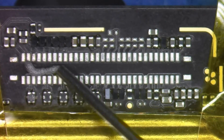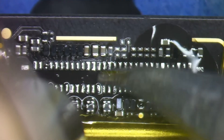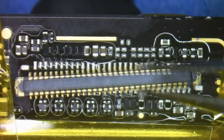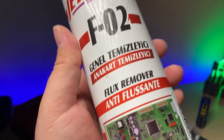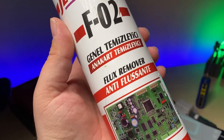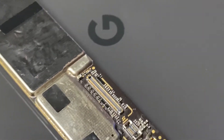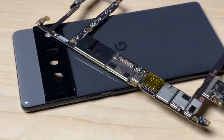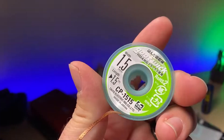One of the more important things is to know the different types of solder and their purposes. If you're working on a component that is going to see repeated action like a connector — where a connector is going to be popped off and put back — using a lower melting solder will not be suitable because it is a weaker solder and will not withstand all of that wear and tear. Whereas a smaller IC chip will benefit from a lower melting solder because it'll be easier for you to apply.